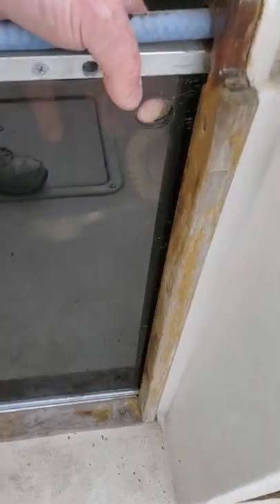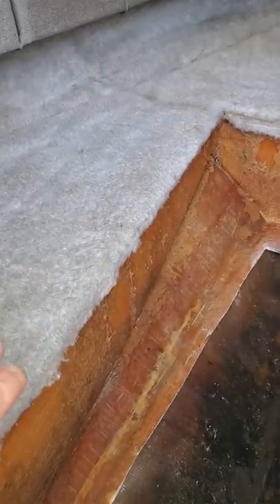The other thing I found when I went into the cabin was the whole cabin floor was plywood, and that had failed — it had just rotted out. Not a good glass job. So I went in with an oscillating tool and cut that out. You can see I've cut it all the way up front here and all the way around, and cleaned that all out for these guys. I'm probably going to have them pull all of this carpet material out, and then I'll have them fiberglass finish it — just spray some gel coat in there and clean it up.